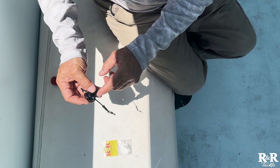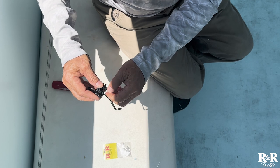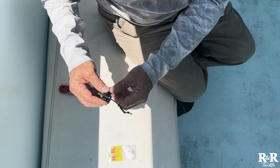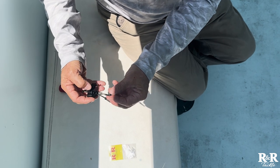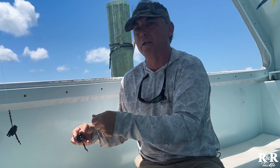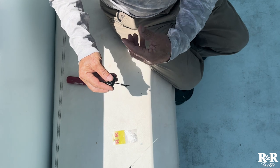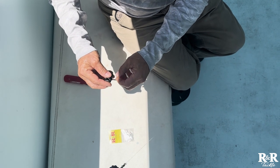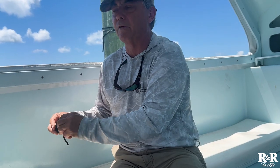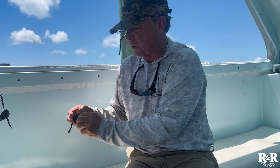Another helpful tip: don't be afraid to pull the screw out occasionally and lubricate it. It's just a plastic screw. The reason we use a plastic screw is not trying to be cheap, but it adds to the lightweight feature. We have an imperfection built into the thread — it's a little bit like a lock nut where it takes a little bit of pressure to turn it. We do that on purpose so the screw doesn't vibrate out while the boat's running. Taking the screw out and dipping it in a little bit of blue grease allows you to have a finer adjustment on the tension that the arm would feel.